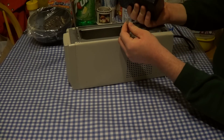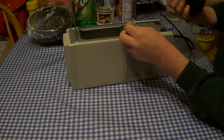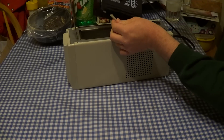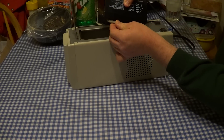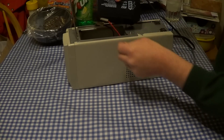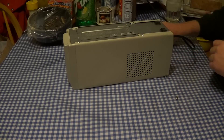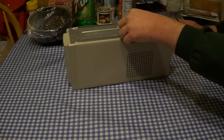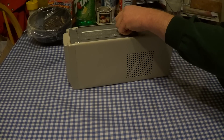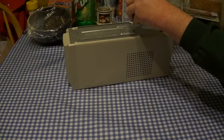We do want to make sure that we get the polarity right — otherwise we'll probably damage something inside this UPS and then it will be good only for parts. I think they want the battery to go in like this, so that's how we're going to try it first. I heard a little peep from inside — it's pretty well-behaved. This is actually a larger battery with a higher current rating, though as with all of these sealed lead acid brick batteries from China, I'm not sure that makes any real difference. The actual manufacturer probably just prints whatever the distributor wants the battery to say in terms of capacity.